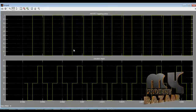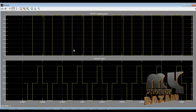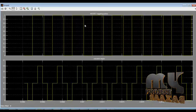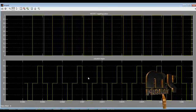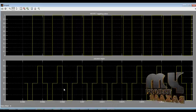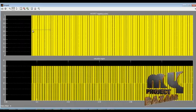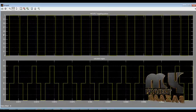Next we can see the maximum power point tracking algorithm, which gives a duty cycle for our triggering pulses to the DC to DC boost converter. These are our master triggering pulses. This is the saturation region of our triggering pulses with the duty cycle ratio. These are some of the levels.